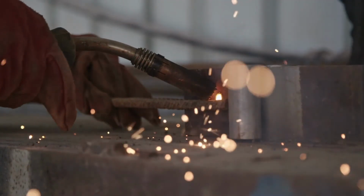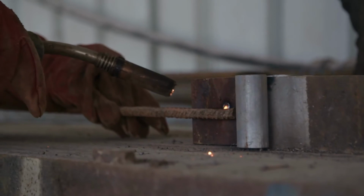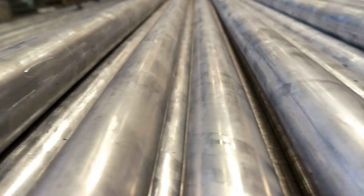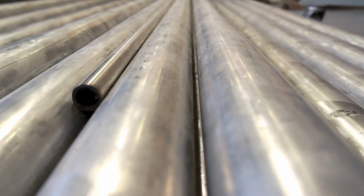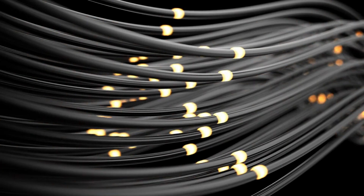However, when creating a private signal, the other factor to consider is the amount of connected metal in the structure. The signal is pulled into the adjacent areas of the building if the metal is connected. There is no way to know if this is a problem without installing a test loop and checking the signal strength outside the antenna.